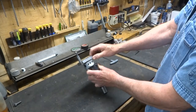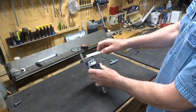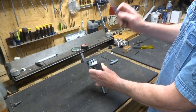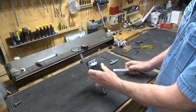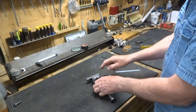And you have 2.4 because you've extended it out an inch, so that means you can almost go to five inches now. Admittedly, if you're taking a heavy cut you probably wouldn't want to be hanging out that far. But for a light cut, you can extend the capabilities considerably by doing something like that.